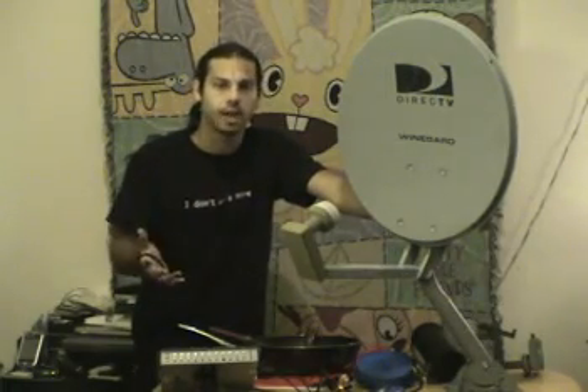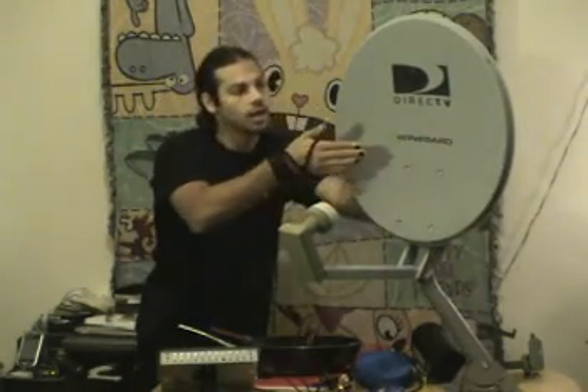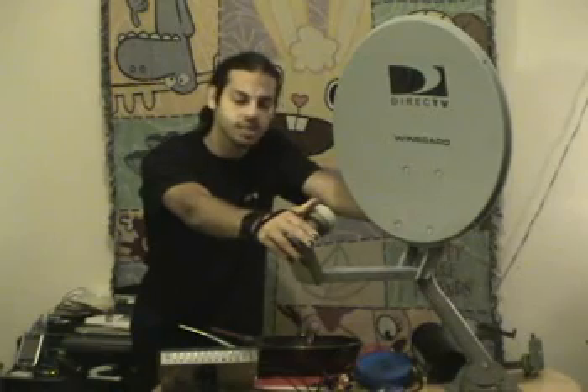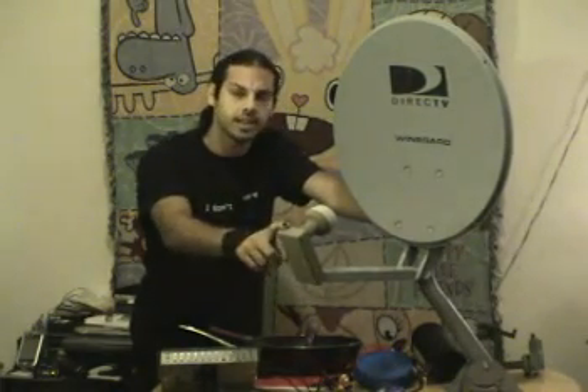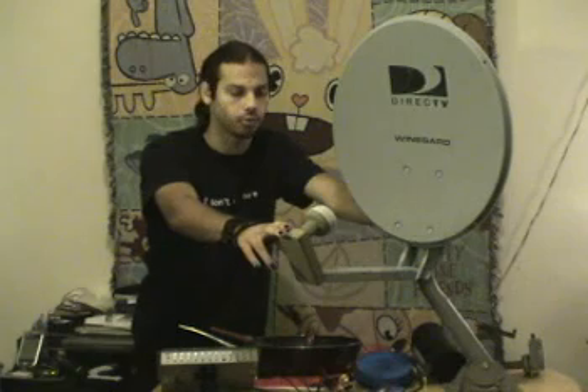Because metal reflects radio waves, that is the fundamental reason why parabolas give us gain. The radio waves are going to hit the parabola and, because of this arc, it's going to reflect off to a common point — this device right here. This device is called the LNB, or the low noise block. This device does not receive Wi-Fi; its only function is to serve for measurement reasons so we know where the focal point is.